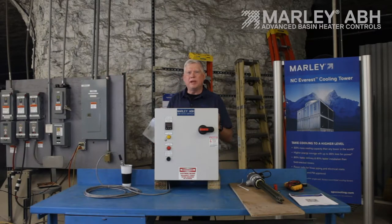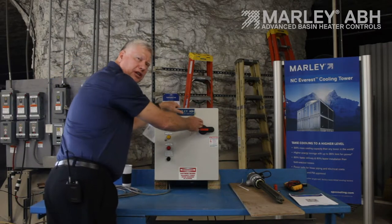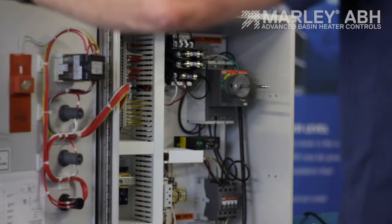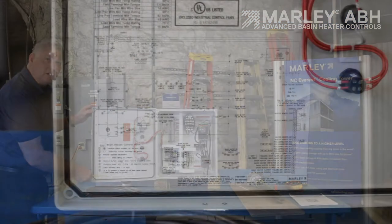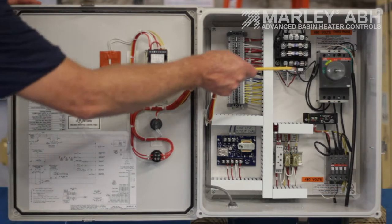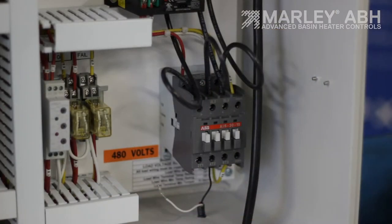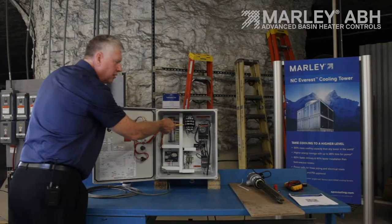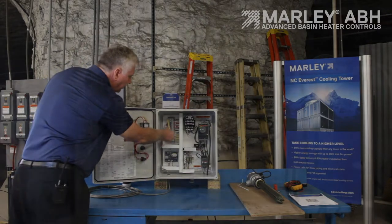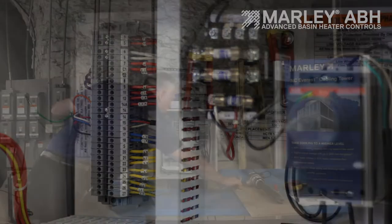Your handle has to be in the off position in order to get the door open. If it's in the on position, there's an interlock preventing you from opening the panel while it's energized. This is the shop drawing for the panel — it shows all your field connections with wire numbers and so forth, so always look at this. Here's your main disconnect, which is interlocked with the handle on the outside. The heater is connected to the three-phase contactor right here. We have a control power transformer to knock down the supply voltage to 120V for use with your pilot control and temperature controller. Over here is where you make your field connections for your RTD and other devices like the TCO.